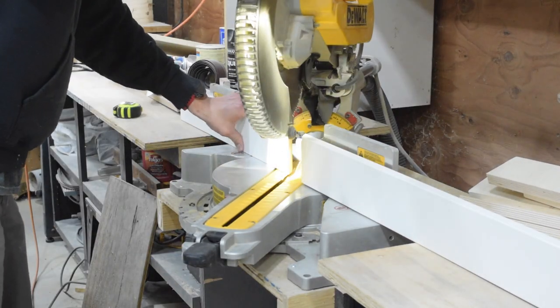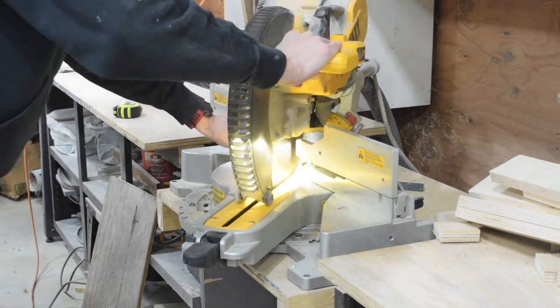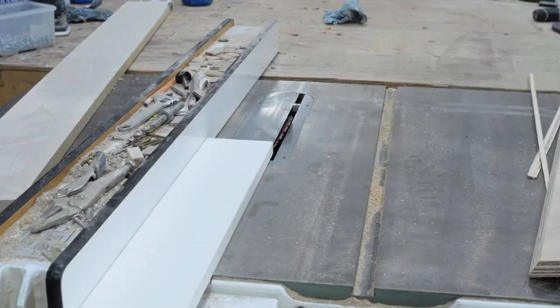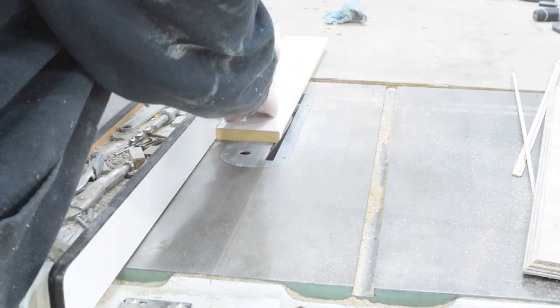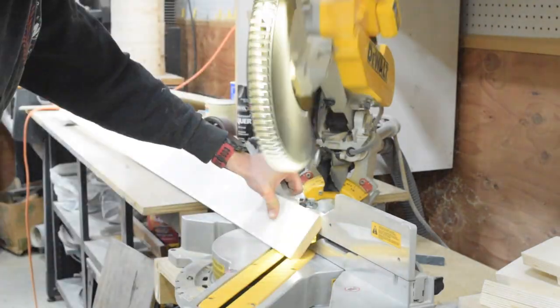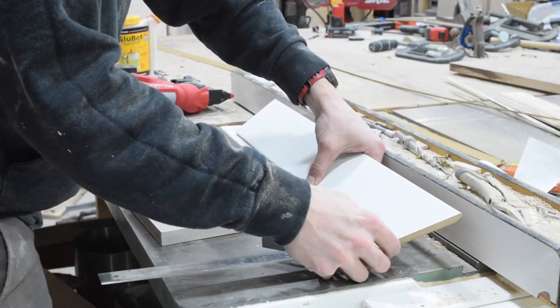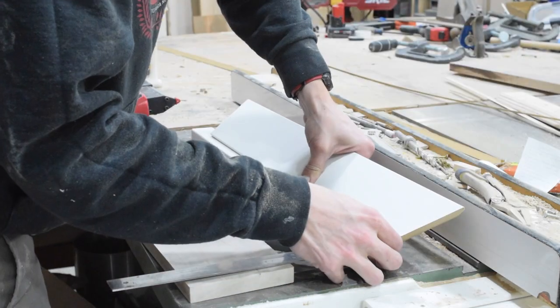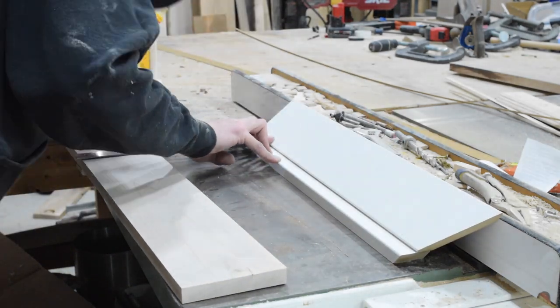I have these large cabinets and this large upright cabinet with shelf pins, and here's the part I thought was really cool — I was actually practicing for another possible job: making up my own crown molding. There is no crown molding in the entire house, and I wanted something very clean and modern — that flat crown look. I couldn't find any flat crown so I had to make my own. I bought stock MDF from Lowe's, cut my 38 and 52 degree corners, and layered that crown on flat stock to build up that custom built-up crown look.